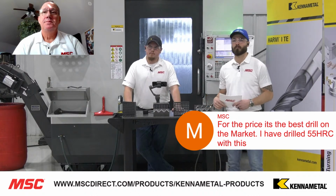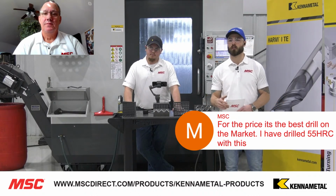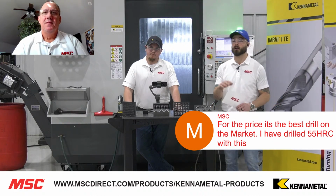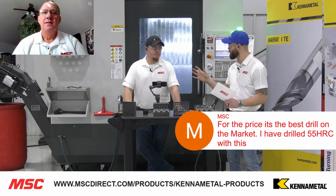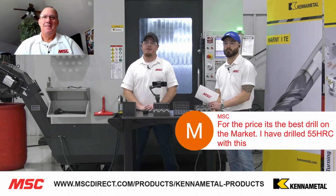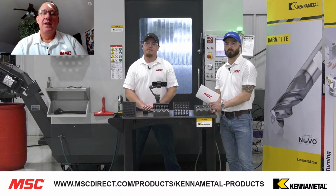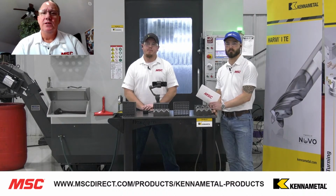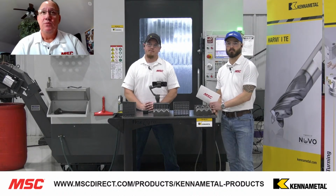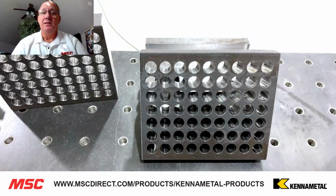Oh, and we have a comment here from MSC Direct. So for the price, it's the best drill on the market. I have drilled 55 HRC with this. So for our viewers, even myself, who may not be familiar with HRC. Are you familiar with HRC? Yeah, so they're talking about the hardness of the material. Tony, if you want to speak a little bit more on what that comment was really saying. Yeah, when we think about alloy steels and softer type materials and that Rockwell hardness, and then he's running 55 and drilling holes in it and loving it. That's pretty hard. As we know in the machining world, that's pretty hard material. So that's excellent. I'm glad he shared that with us.